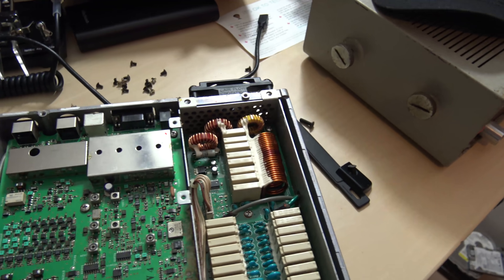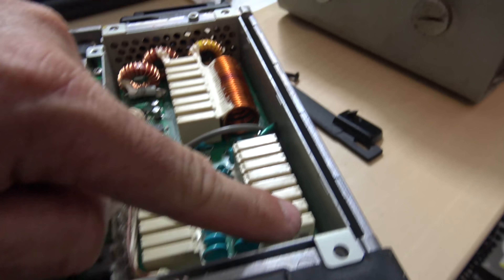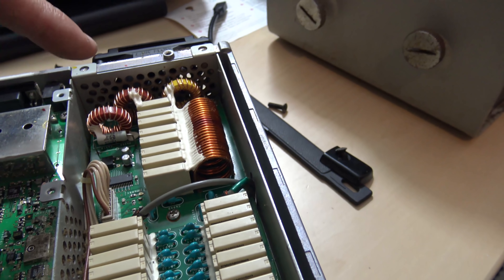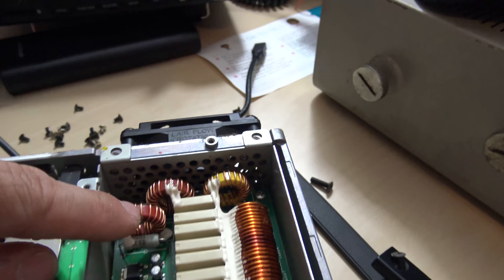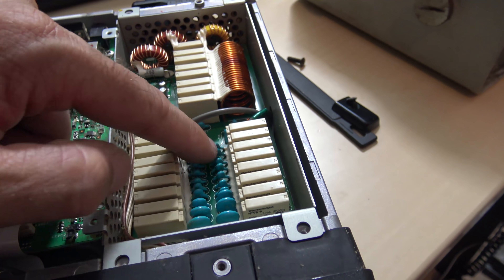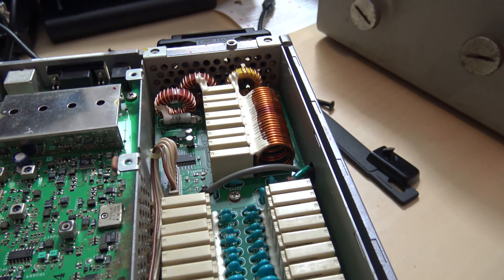So I took the cover off the tuner. There's a bunch of — that's the air intake there. The fan is here, so they're also pulling air through the tuner. You can see that's a bunch of crap. Here's your other relays, and you have capacitors, the relays, and inductance over here. I'm a Yaesu tech wannabe. These are based on the L marking — L for inductance. So it switches in the appropriate capacitance and inductance, almost like an MFJ auto tuner, to make the appropriate tune on your radio.